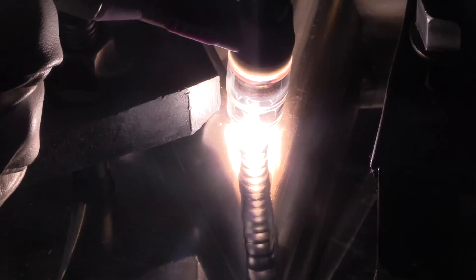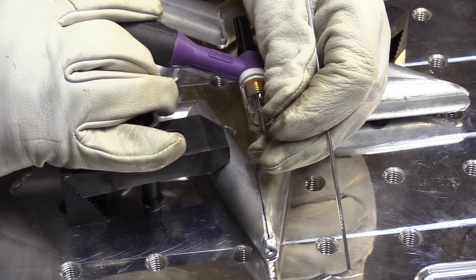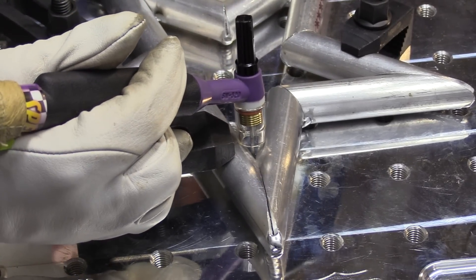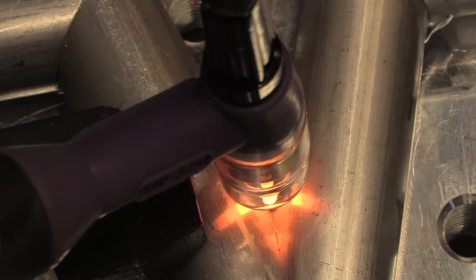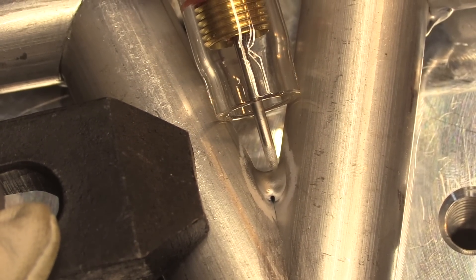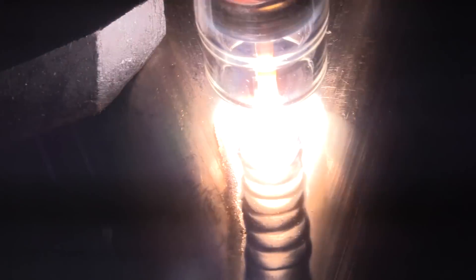There are a lot of different cups you could use on this job — a lot of people like to use a number five standard cup. I flicked the electrode with the rod, so after cleaning it up I'm going to extend the electrode a little bit and weld that tight angle. That's a good thing about this gas lens number eight cup — I can extend the electrode quite a ways and still get good coverage. That's pretty much what's called for on these tight angles. A big cup allows you to extend the electrode farther so you can sometimes get in a tighter space. Sometimes I'll even wad up a piece of aluminum foil as an air dam to prevent that Venturi effect. Here's another shot of me twisting my wrist trying to maintain a good angle, sped up a little bit.